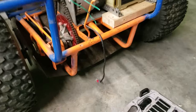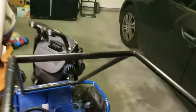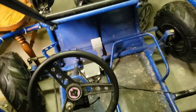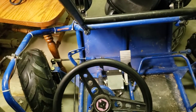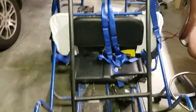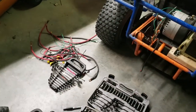I'm also going to try to move the throttle — it's got two black cables hooked up to a potentiometer, a forklift throttle, with seven wires coming out of it, but I only need two because my Altrax controller doesn't recognize the rest anyway. I'd also like to push it farther back because right now it's squished in there at a weird angle. I've got all my cables on the floor here — I think it's 0 and 2 gauge cable — so there's plenty of power behind it. The go-kart is totally a work in progress and I hope to have it done shortly — I'm waiting on parts from Amazon.